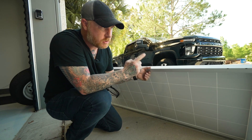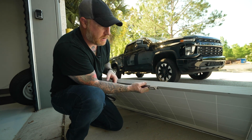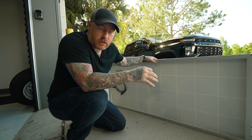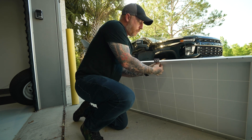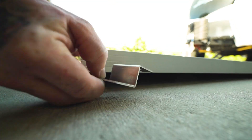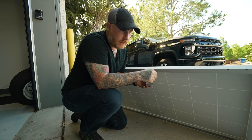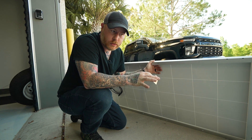The panels come with a little bracket that screws to the bottom of the panel and then you screw that bracket down to the roof, which works great until you need to change something — add panels, move the configuration, replace the panels. The problem is you're forced to work underneath the panel with only about an inch of clearance, making it hard to get wrenches in. And you don't want to unscrew the bracket from the roof because you'll have sealant all over it and holes to reseal.